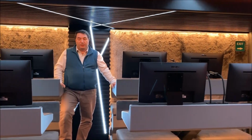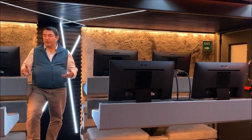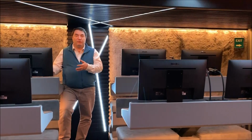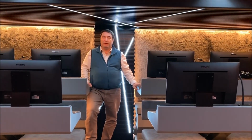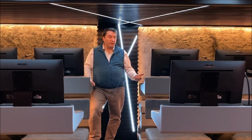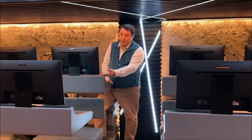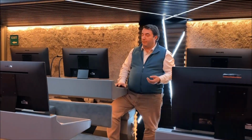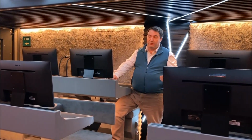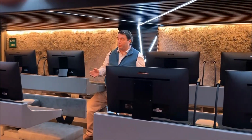Also, additional care has been given on how high they are going to sit and what should be their ideal monitor size so that they can have at least some visual contact with the main monitor wall on the other side of the vehicle. So for this purpose, we try to mount the monitors as low as possible while still providing them easy hand access for the areas where their intercom or router control panels are going to be positioned.